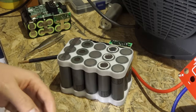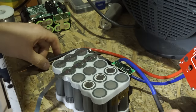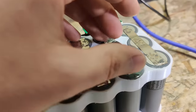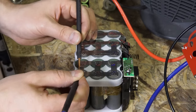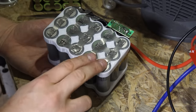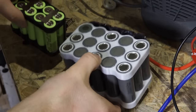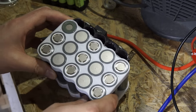These extra protection pads on the positive side of the batteries make sure there definitely won't be a short. Mine are a tiny bit too small because they're actually for 18650 cells, but I'll link the right ones in the description. I'm working on one side of the battery first to prevent causing a short with the other cells in series. Batteries from the factory usually only use two to four welding points — I'm probably going a bit overboard, but I'm always rather safe than sorry. If you like what I'm doing here, a sub would be massively appreciated — this video took around eight days to produce. Feel free to type suggestions for future videos in the comment section. Now back to the battery.